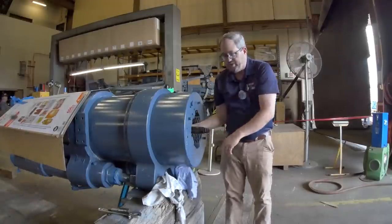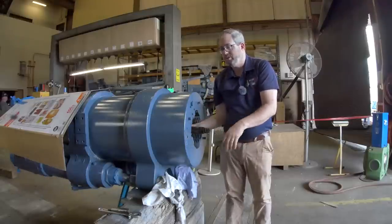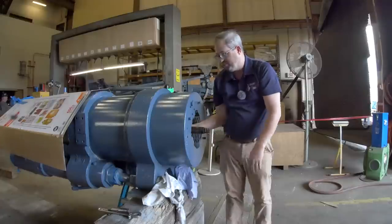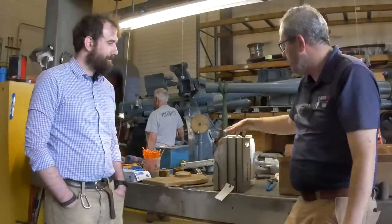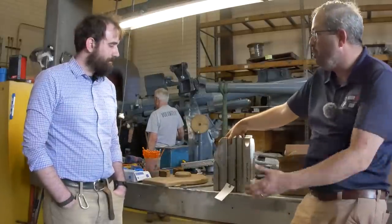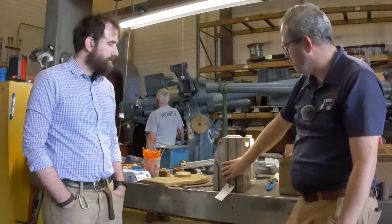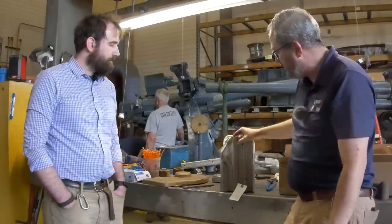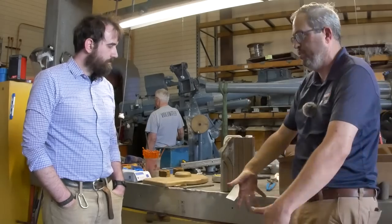All the grease — the goopiness of this breech assembly — is just paint on grease. We put grease over the teeth or the threads to protect them from the paint when we painted this thing. So the other type of breech block you mentioned is the vertical sliding breech block. This is a breech block from a 3-inch 50. You have these nice mortises here that the block slides up and down and keeps the block aligned.